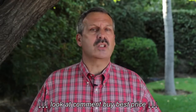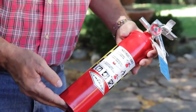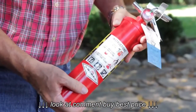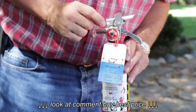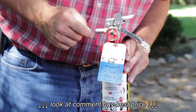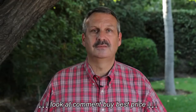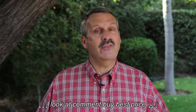Last, take a look at the tamper seal — is it intact? Take a look at the body of the fire extinguisher. Remember, it's a pressurized vessel at about 125 pounds of pressure. Look for any dents, dings, scratches, rust, corrosion, anything of that nature. Now let's look at the gauge: is the needle in the green? Remember, it's an analog device and it may be stuck — tap on the gauge a couple of times and see if it drops out of the green.